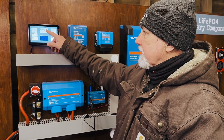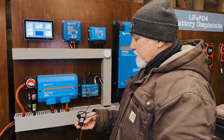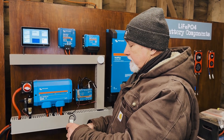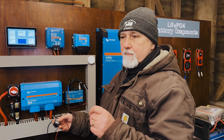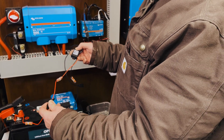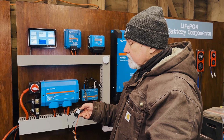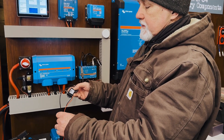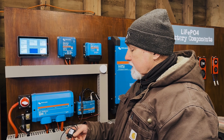This is our preferred approach in the vast majority of cases where we need to extend the cable, which is almost every Cerbo GX installation we do. We run the HDMI extension with the 2.5mm black and red. You must fuse it — we've got a little spade fuse here. Five amps would be fine; the screen draws very little current. Fuse it close to the battery and run that. Just use WAGOs — these through WAGOs we've used here, or any method of joining — and you get two USBs at the GX Touch 50 or 70 screen. That works really well.